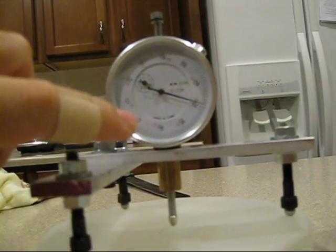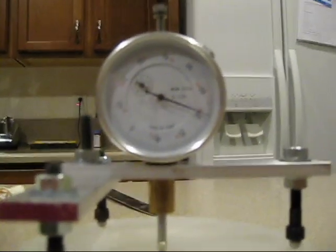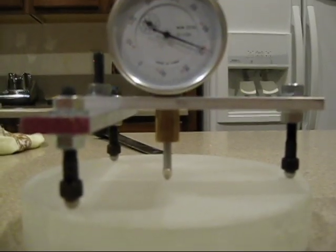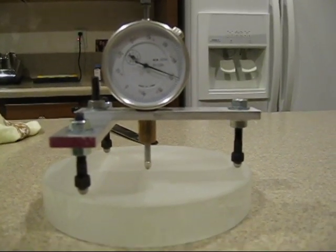I've done some rough grinding for about two and a half hours and I'm pretty happy with the result. I can see the surface has got a white coloring to it, so it definitely changed the surface. I used my spherometer to measure more or less the curve I got. I zeroed it on a not perfectly flat surface, but I got a reading — it looks like I've taken away about 31 thousandths of an inch. I probably have about four to four and a half hours of work still, just for rough grinding.